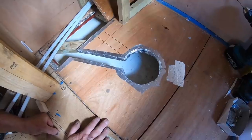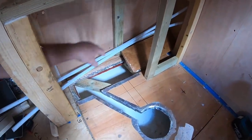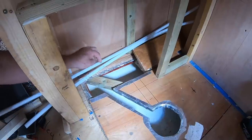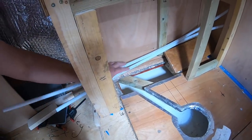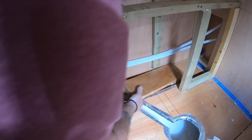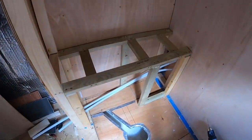weight. Take out some weight, and also it's easier to manoeuvre everything. These two pipes here that you've seen before from the shower mixer are going to obviously sit under this seating area here, and I'm going to put the fittings, the connections for these, in this sort of area, not down here, so that if ever again there's any snags or whatever, I can get my hand in there and deal with that if there's a problem in the future. And then this will sit back into there.